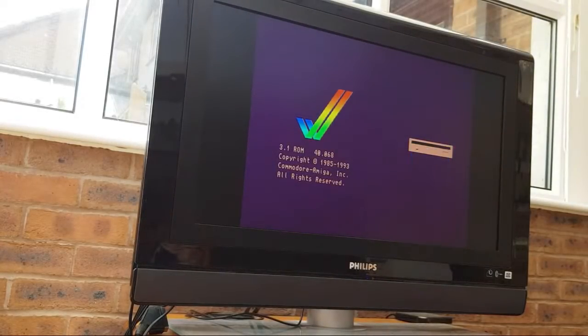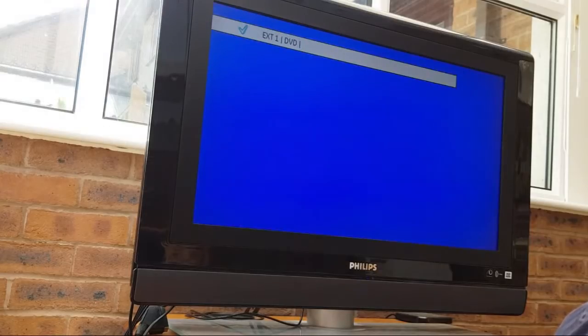So, I don't know. What I do know is the other board is behaving very differently since we've changed those chips over. This board takes an incredible amount of time to look for the drive. There is still a difference between these two boards. The only thing that's different here is this has got one of its original Philips HCT chips on the board there. So, I'll just try that again. But I'm guessing it's nearer to 60 seconds on this one, isn't it? It is absolutely bizarre. But doing what we did to the board has made a difference, definitely. It's more than double the amount of time it's actually looking for the drive. But that ain't 15 or 16 seconds like it is on the other board, is it? It's over 30. It must be getting on for 60.